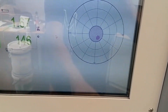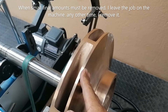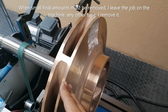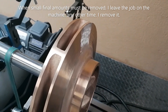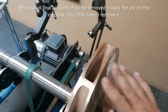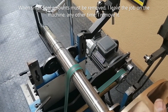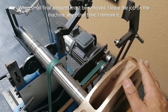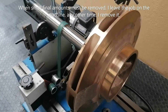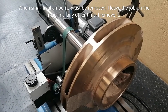I'll switch the machine off and start grinding again. I don't actually remove the impeller — I just touch it with the grinder while it's on the machine, because there's not much to come off. It's at 150–151 degrees, which is roughly there. I need to take off about one gram.